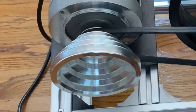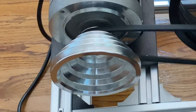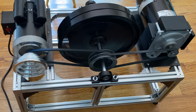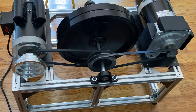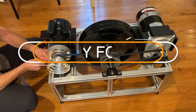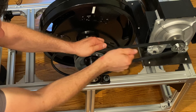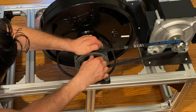The first test run was a total disappointment. The motor draws too much current before it ever even reaches max speed and trips the circuit breaker. After trying this a couple of times, I decided a redesign was required — I would use a motor that uses less horsepower and draws less current.